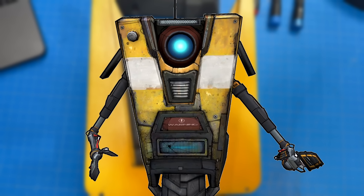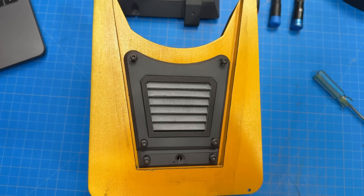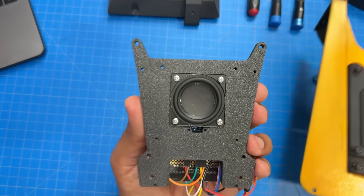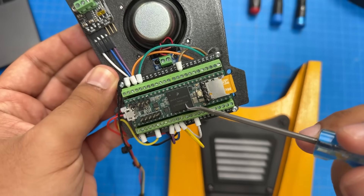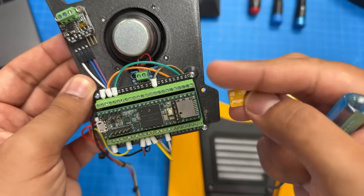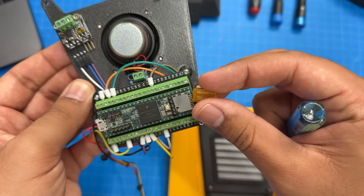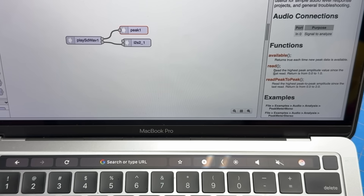Claptrap has a loud voice and thankfully he doesn't have any weird photorealistic lips, just this little louvered vent in the front which is presumably his mouth. In order to give him the power of speech, I've slapped a five-watt speaker behind his face plate, powered by a small amp connected via I²S to this Teensy 3.5 microcontroller. The audio clips are stored as WAV files on a microSD card, and for right now I can just trigger them via serial. The Teensy platform has a pretty powerful audio library, so I'm using that to play sound effects. To modulate the brightness of his eye, I'm using the built-in peak meter function. The eye has a base level brightness and the peak meter modulates the brightness on top of that to get just the right effect when he talks.